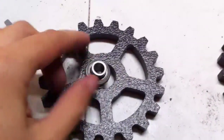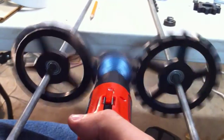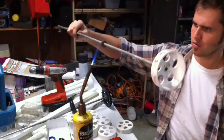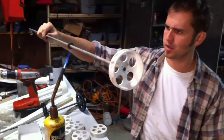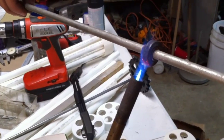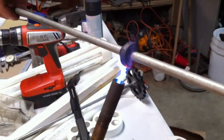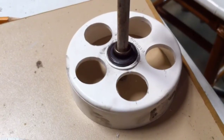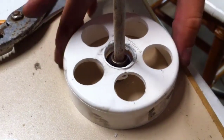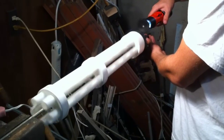The holes in the bearings were 5/16th inch. After a little digging, we decided on a pair of old baby bed guide rods. They worked really well, but I realized I had no way of pressing a bearing-sized hole into the 3-inch pipe cap. Being very far from a drill press and close to the deadline, I grabbed a blowtorch, superheated an old bearing, and shoved it through the molten plastic to create a bearing-sized hole. It took a couple tries and we ruined several caps, but we finally melted holes close enough to center to match the precision of the rest of the project.